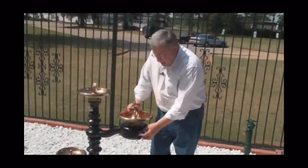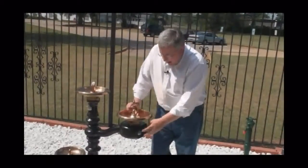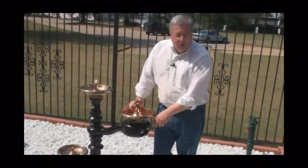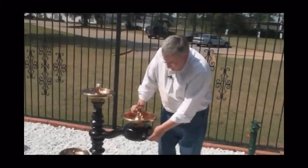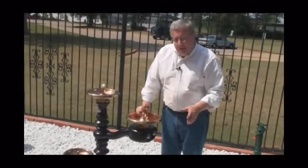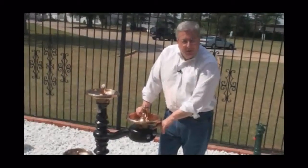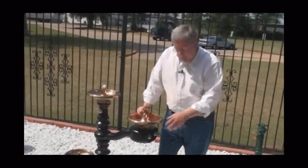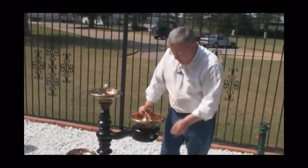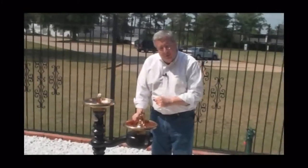And again, the good news is that's the only working component here on any of these push buttons on the drinking fountain. And what I would recommend doing, if you have a question about the lines being full of debris, simply pull the cartridges out, turn the water back on, and flush everything out very well. That way you're going to get rid of any grit, gravel, pipe dope or any Teflon tape along there that would come flushing out very well. Make sure you have good streams of water, turn it off, and then reinsert the cartridge. And hopefully the cartridge should be in good shape enough to be able to do that.